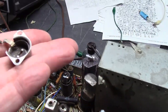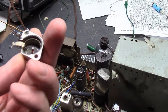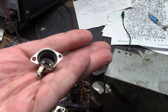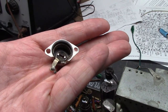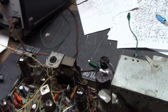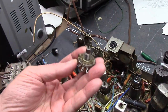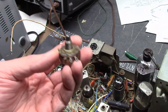I also need to replace the linearity control. Here's what one looks like — or similar to this. The body is one end and there's a wiper for the other, and it's wire wound. Really prone to breaking because they're all exposed — it's a piece of metal rubbing against resistance wire — just not a good design.